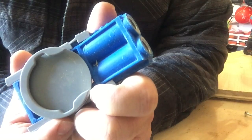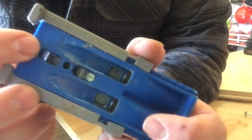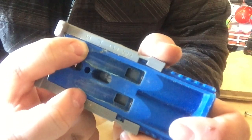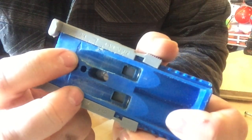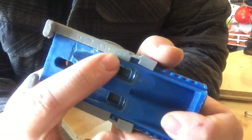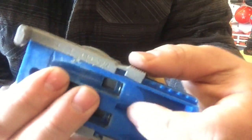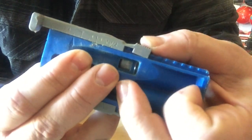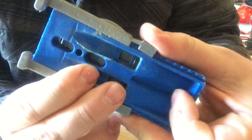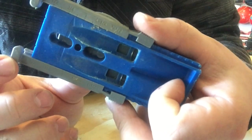After you adjust the collar on your drill bit, you need to adjust your pocket hole jig block. If you look on the bottom, you'll see these measurement marks. These measurement marks correspond with the thickness of the wood that you're trying to drill. Ours is three quarters, so I've got the arrow right here set to three quarters. There are all kinds of measurement adjustments on here depending on how thick your workpiece is. To adjust this, you just press down right here on the end and you can move it up and down — get it to where you need it set. You've got to do it on both sides to make sure that they're even. Once these are set, you're ready to drill.